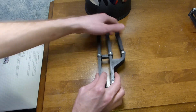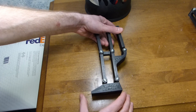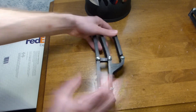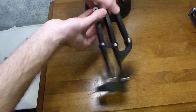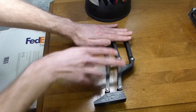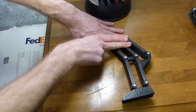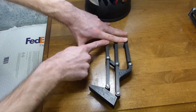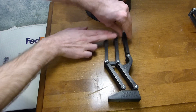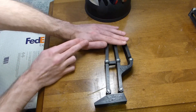But I did print a couple of models — four legs. These ones would be more oriented for a two-leg robot than for a four-leg robot. The idea with the two designs I'm going to show you is that they can be controlled completely up at the hip, without any kind of motors down in the lower leg — just basically metal rods sticking out. So you have this center piece that swings it forward and back, the front piece alters the foot angle, and the rear piece alters the lower leg angle, and they can all be controlled independently.